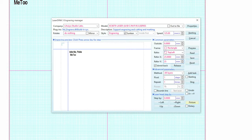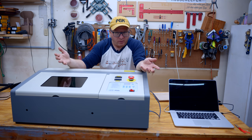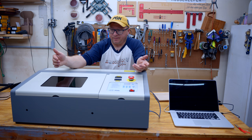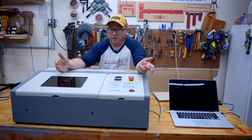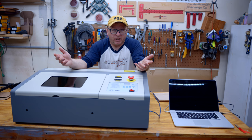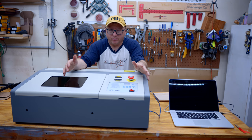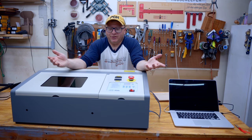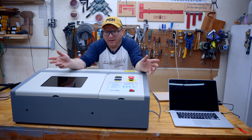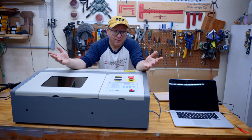I did have a bug in the software I really couldn't figure out. I played around with it and got it working, but it would home properly and then I'd tell it the machine was 300 by 225 millimeters, but it would only allow me to jog about 95 millimeters down and about 120 millimeters over. I couldn't jog all the way to the end of the cutting area. I played around with the offsets and settings and was ultimately able to get it working once. A few days later it was not working again, and I had no idea what I changed.